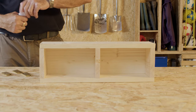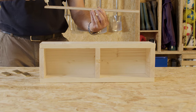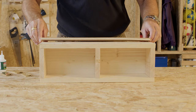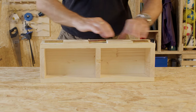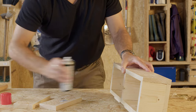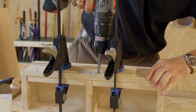It's important to wait until this stage to finish the bracket box, to avoid any issues with misalignment or miscalculations. Returning to your bracket box, you can now glue the packers into place and mark the location for your pilot holes using the hinges. Add two extra wooden inserts to give your bracket box some additional support — glue them into place, secure them with clamps, and then screw them into place.